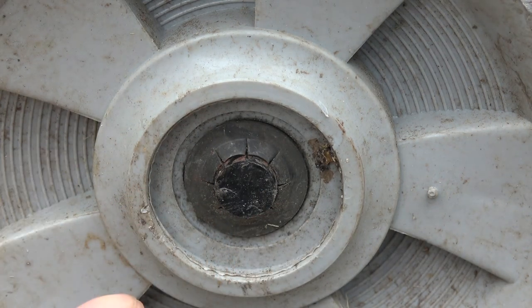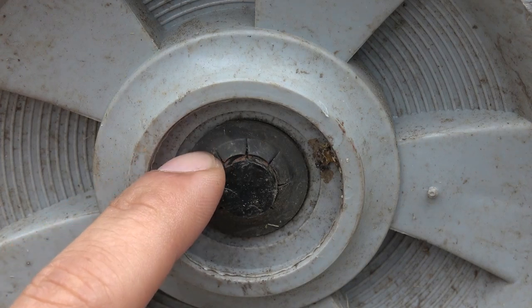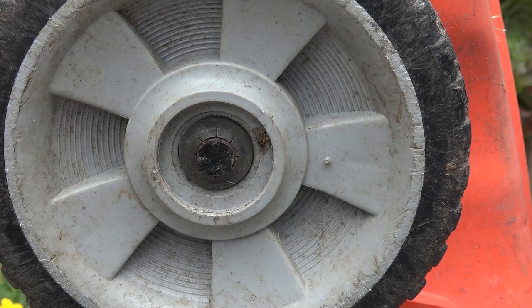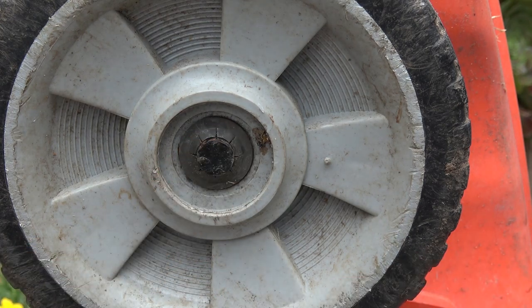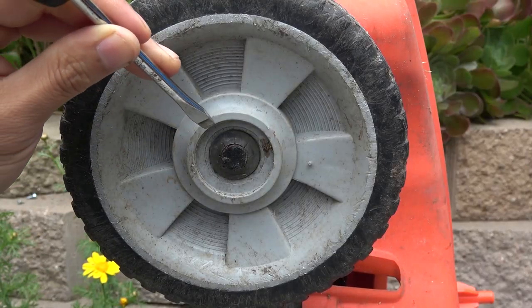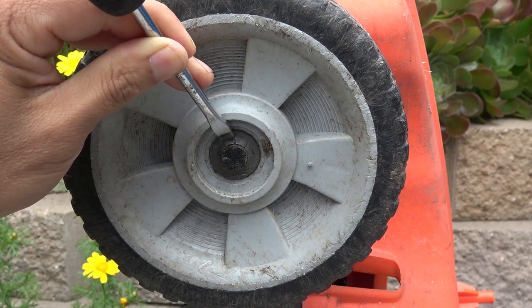So in this video, I'm going to show you how to remove this ring easily and quickly, and you can even reuse this ring. The way I'm going to do this is to weaken the teeth of this ring by using a flat head screwdriver. I'm going to use this to pound on the teeth of the ring perpendicular to it at this angle, just like that.